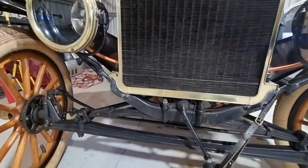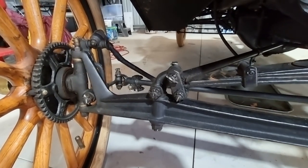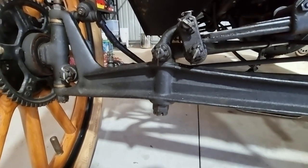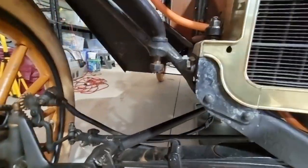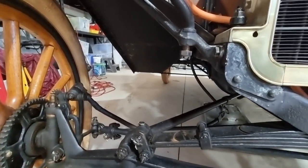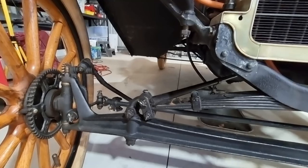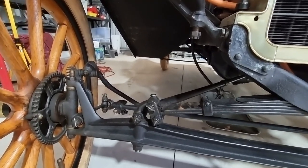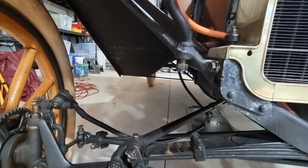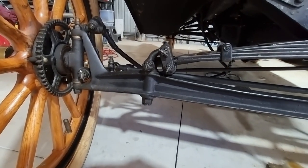Welcome to Part 2. Today's project I'm going to be looking at cotter pins, also called split pins. I've gone through the car more thoroughly now and it's a little bit worse than I thought — the majority of the rear ones are missing and a few of the front important ones are missing. This one was actually hand tight, probably a result of vibrating loose. I actually had to drill one out as it had a piece of rusted cotter pin left in it. Part of the reason this happened is that it probably had sheared off cotter pins and someone took a shortcut.